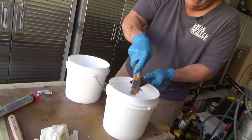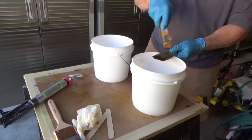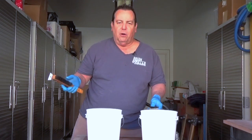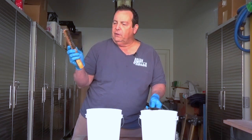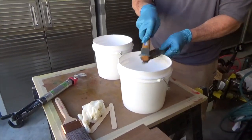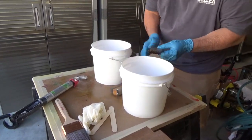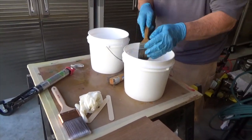Now on the edge of the bucket, we're going to take a simple wire brush and gently wire brush this. Now if you go to the paint stores, the big box stores, they'll sell wire brushes, but the tines are spaced really far apart. That makes zero sense to me. These bristles are very fine. I want to use a brush like this. I'm not very aggressive with it. I'm gently brushing this down like so, on the edges as well. Dip it in again. I've got that finish loosened up.